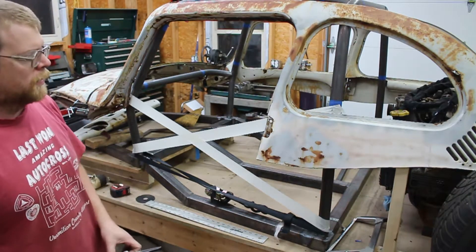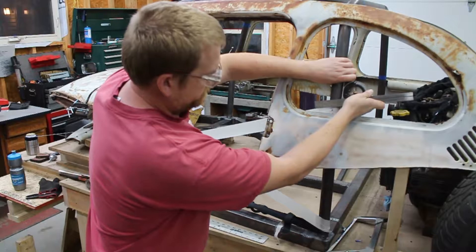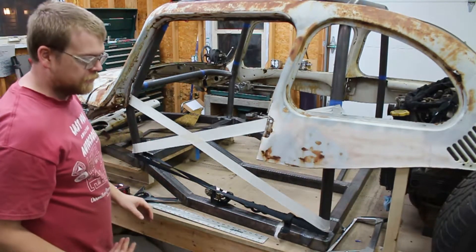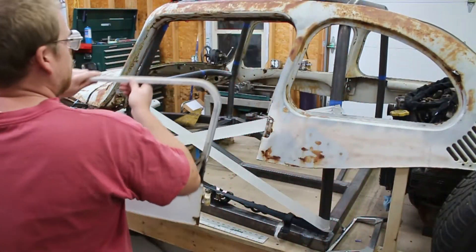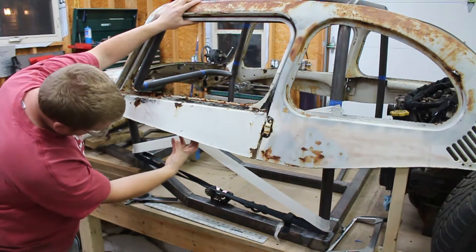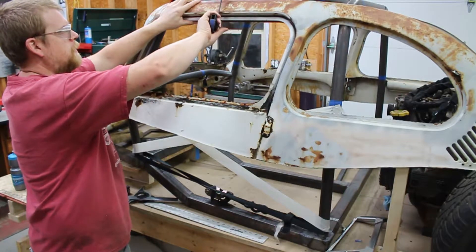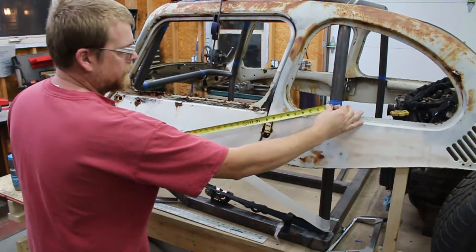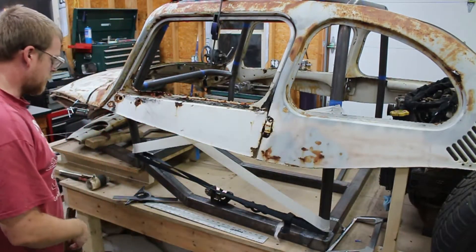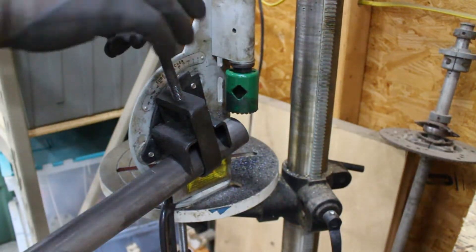To build this, I put the tape on and I'm going to start by getting the angle here, then measure that angle. Because it's going to have a bow in it, I'm going to bend it all the way out to the door, which is about a six-inch bend. To ensure that I've got enough tube, I'm simply going to measure along its path, including the bend. I got 42 inches, so I'll cut a piece 42 inches, put this angle on the end, and then bring it over here and figure out where to place the bend.